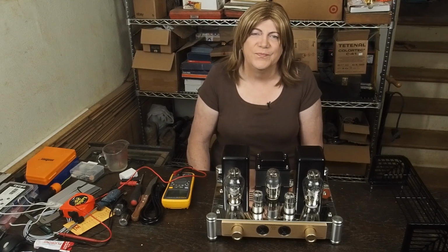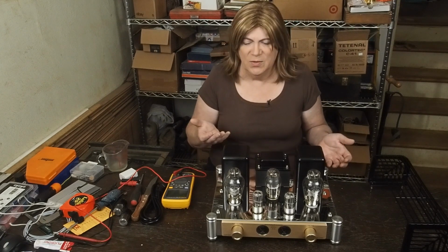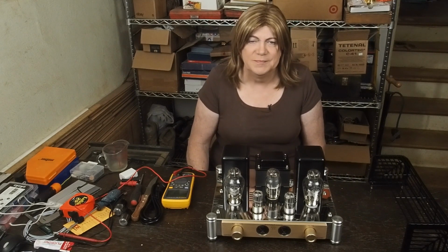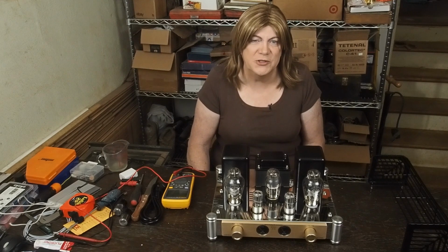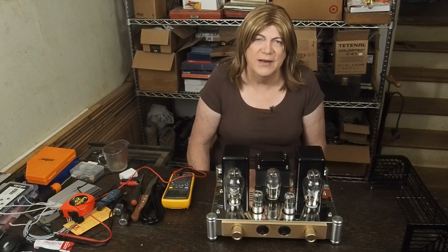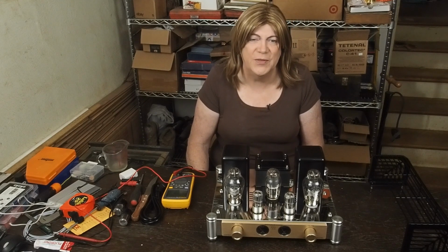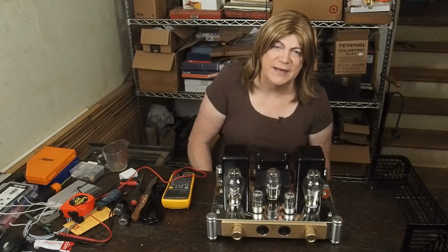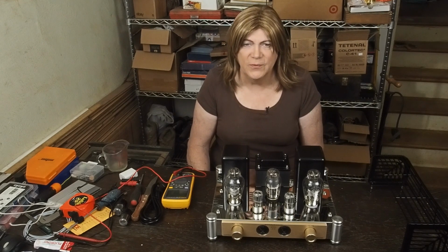So that's it for this short video about my initial listening to this amp. I do think that it sounds pretty decent. It's really a 3-watt amp by my measurements, not a 7. You need to have some super efficient speakers like some of these Klipsch or something, ideally over 90 decibels per watt. And I think you'll really enjoy this amp.